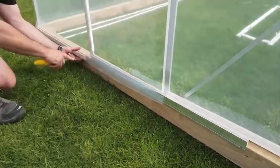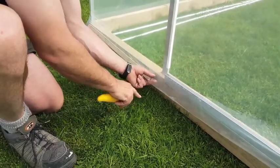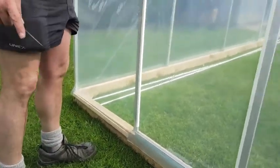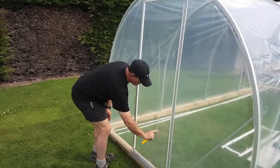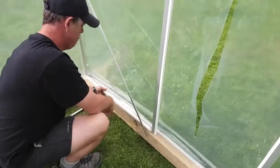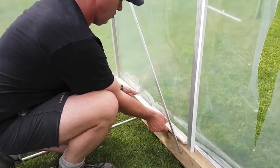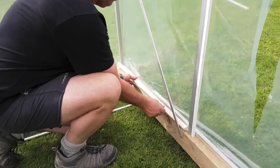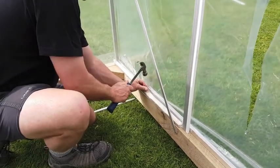And then we do the same on this side — cut on the edge, below the weld, and then in towards the middle of the greenhouse just a little bit. Then we need to get inside, so well down from the door head we just do an incision straight down, big enough to clamber in. So for the front battens, what we do here is we just roll the plastic and get it reasonably firm, and just tack the middle one.